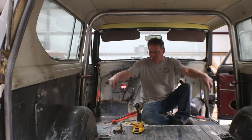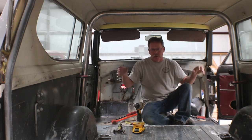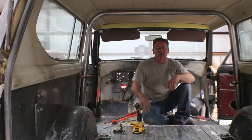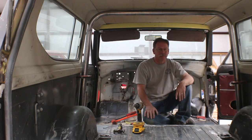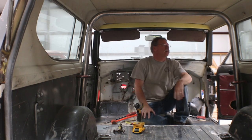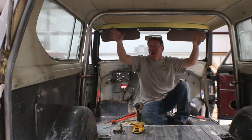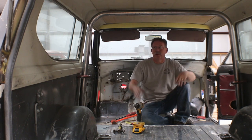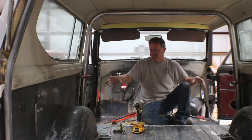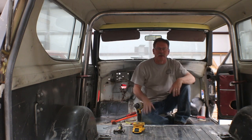The base plates right now just have a couple screws holding them to the floor. Once there are some really good solid tacks on there, I'll take those screws out, take the whole thing out, take it outside, and weld all the way around - that way I get to the back sides of the tubing so everything's welded solid, then I can put it back in. I've got good clearance up here, it's not touching anything, I've got clearance over to the plastic - I think it fits really well. I got within about 0.2 degrees of getting the two bends identical, so close enough.